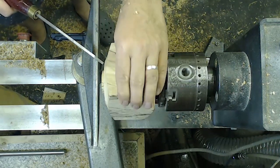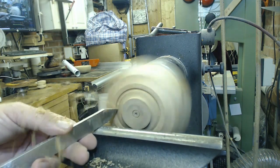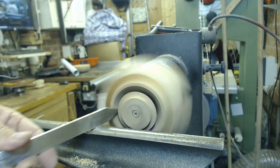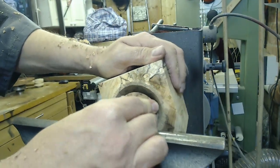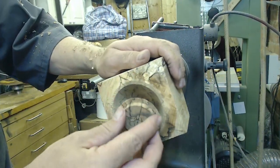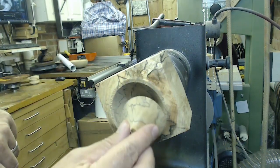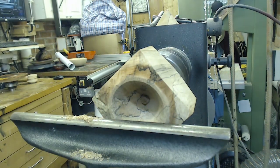But before that, because the competition was about using everything from a cube of wood, I needed to turn the lid from that cube of wood as well and I didn't want to lose too much height. So I took a little core out using my parting tool, just going in at an angle and taking out a cone. Far too small a piece to use any of those proprietary or commercial coring systems that are out there - although maybe you could use a very small McNaughton one. But a parting tool for something this deep was fine and didn't pose any problems.